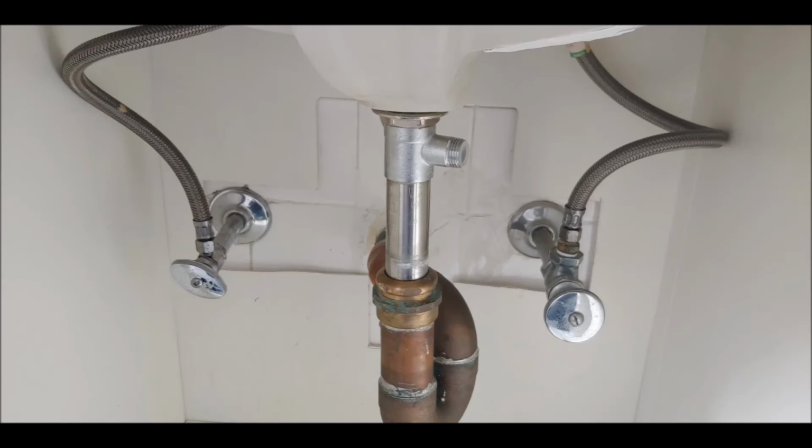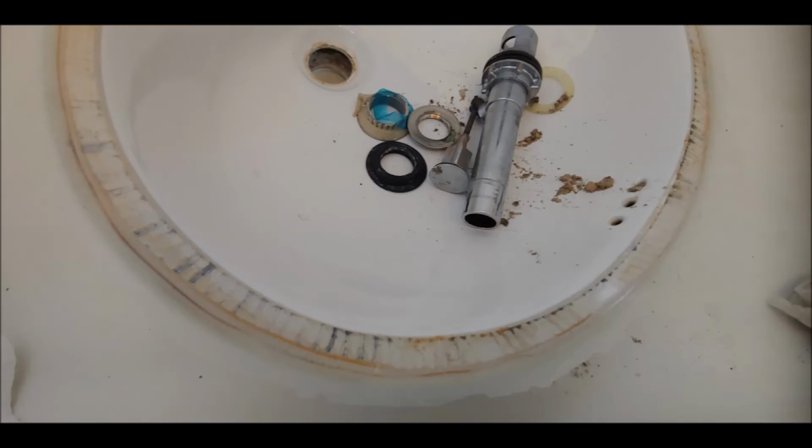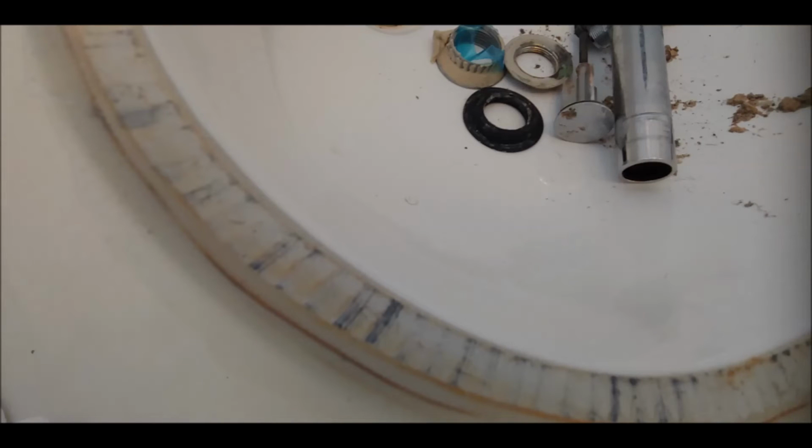Now, at this angle, you could see you still have to loosen that other piece that goes down to the main piping. So after you do that, it wiggles out, and the whole entire thing comes out. Now you can see here I have the old undermount out, and you can see all the scrapes from the putty knife when I'm doing all of the pushing at an angle, just to give you an idea of all the glue and the caulk that's right there.